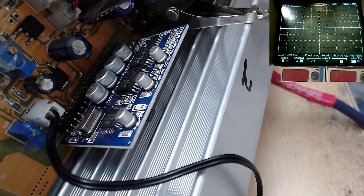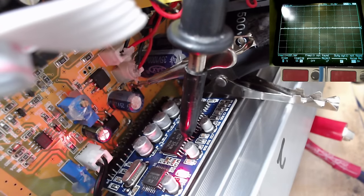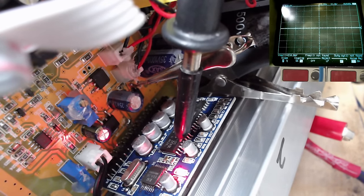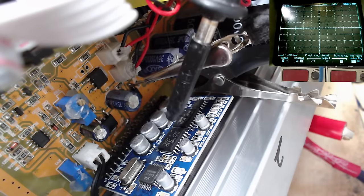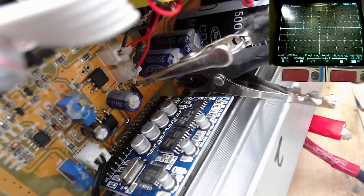That's really strange. It seems that we don't have output from the 2110s. So nothing on this input. Let's go to high input. And nothing there either. So this one's not getting any drive. So let's trace back with the multimeter and figure out why.